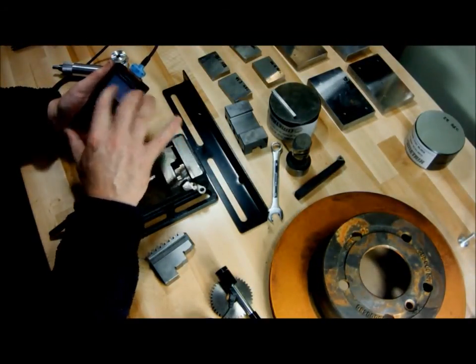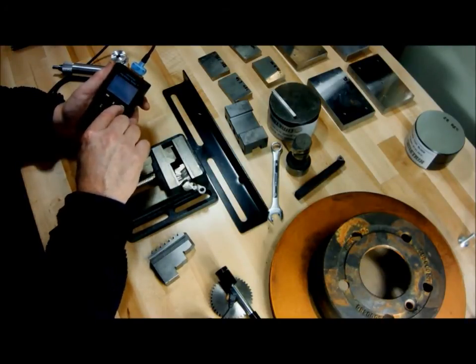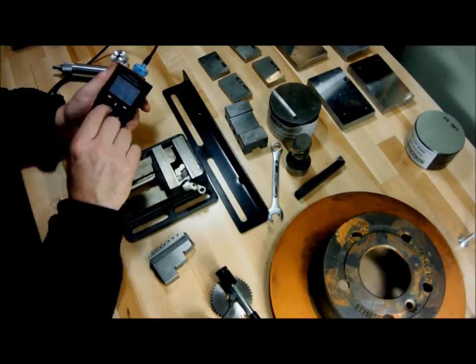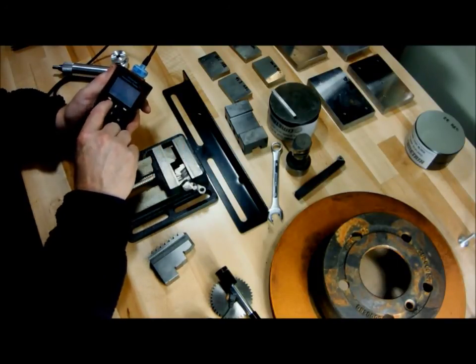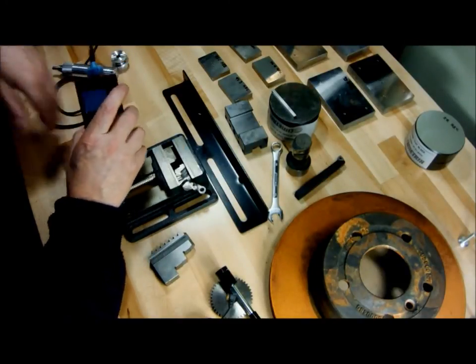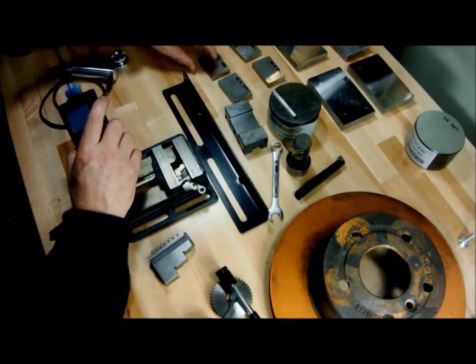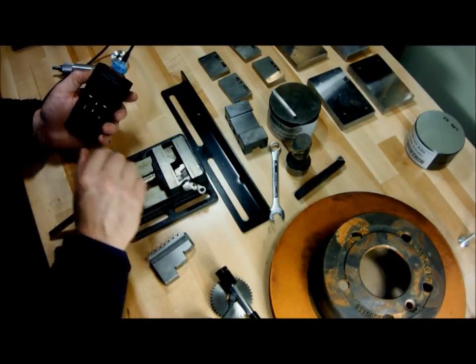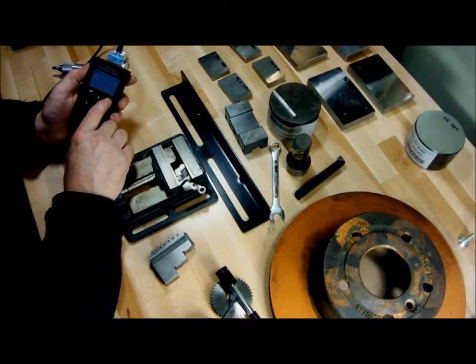For example, if you knew you wanted to do testing against a high carbon steel around 40 HRC, you could buy a round 40 HRC test block and set up the tester to do that. I'll power on to show you. I go to menu, then calibration — I can calibrate with one point or two points. If I do one point and hit select, I want to calibrate to this test block. It tells me it's 41.6 HRC; I might do a couple of tests to get an average, but to calibrate I just type in and change my value to 45.3, add with the up button, and save. Now that has been calibrated for that material and hardness range. You can also do a two-point calibration — that way you can do a plus/minus range on a material, say from 95.1 to 60.2 HRB, or 45.3 HRC to 62.1 HRC, and measure within that range as your own user calibration.